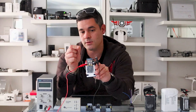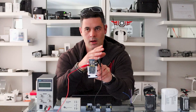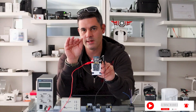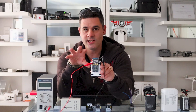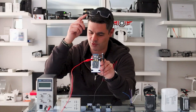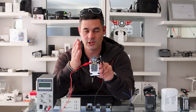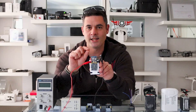Generally we trickle the voltage in, take the battery off, give it about 10 to 15 minutes, then measure each and every single cell to see where the voltage is. In previous cases we've had cells that are beautiful — every one charged up and holding voltage. Other times we've charged a cell up, taken the charge off, and within 50 seconds it drops right back down to zero. That is a completely shot cell — there's nothing you can do with it.